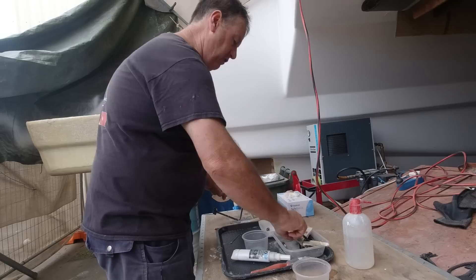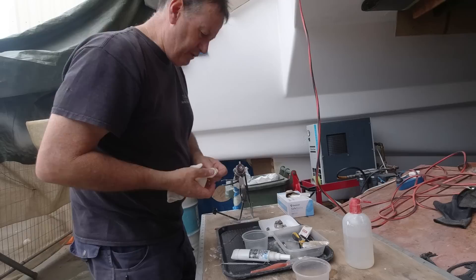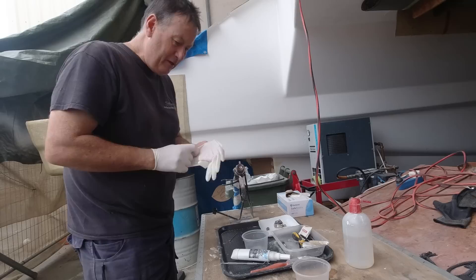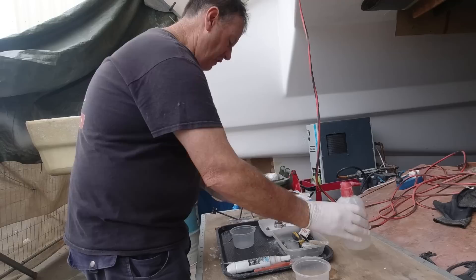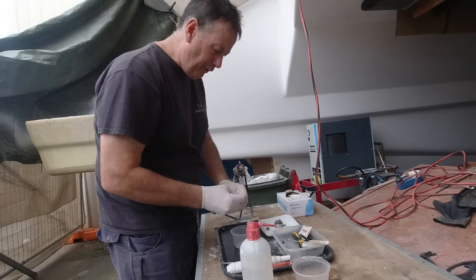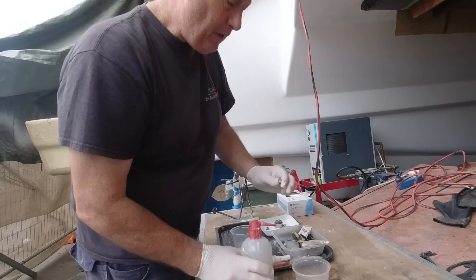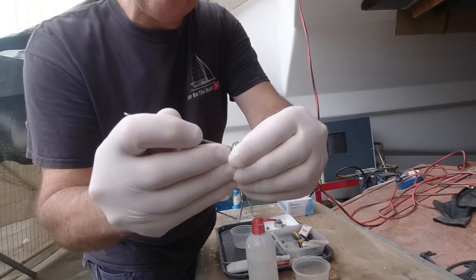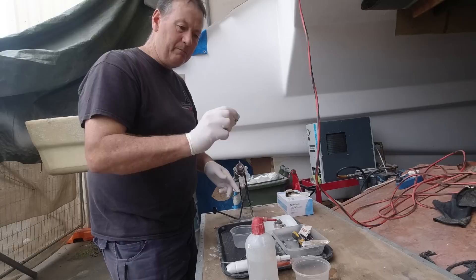With that extension now gelled up, I'm going to work through the maintenance of the gun I use to apply the resin and gel coat. Cleanliness is next to godliness in this operation. Our Graco RS gel gun is made up of many parts that need regular attention at given intervals. As a young bloke I was a regulated service technician for a large Sydney-based dive operation, servicing self-contained breathing apparatus including positive pressure systems for hazardous materials — those skills have come to the fore here. Residue can quickly build up; the small ball valve at the spray tip can easily become gummed up with resin.